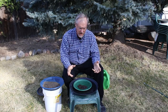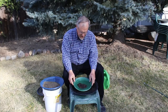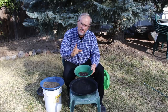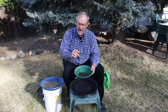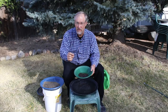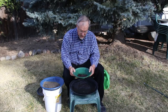I'm back and I've screened out all that material into four separate sections. I've got three screens, so you always end up with one more section than the number of screens you have. This is the over-12-mesh material — meaning it's bigger than about a tenth of an inch. When they say mesh, it means meshes per inch — total space — and it includes the wire too. So if you have 10 meshes per inch, the hole will be less than a tenth of an inch square because it has to include the wire diameter.